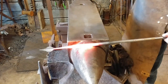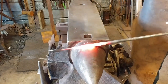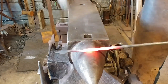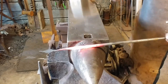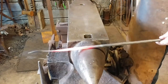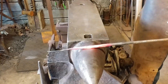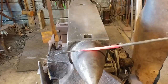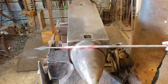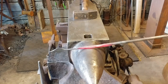We got our handle portion nice and hot. I like to do a little bit of a quarter turn or an eighth turn every time I hit and progressively move up the stock. I find that this gives it that lumpy texture of like a stem — it makes it more visually pleasing. We'll just work that on back into the colder area to provide a little different texture. Remember, we're not trying to go for smooth; we want to go for nice and rough looking with a stem.